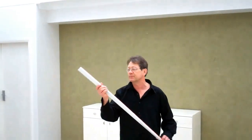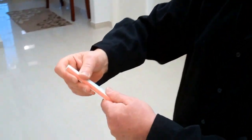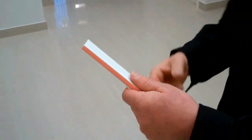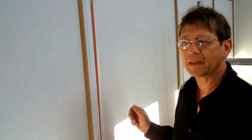And we're going to use this profile, which is very easy. We put some fabric in, and we clip the fabric, we stretch it. It's quite simple, it's a simple process. So for cost effectiveness, we are trying to create panels as big as possible. So in this case, we divide the wall in 5 panels to have maximum use of the fabric and minimize the waste.